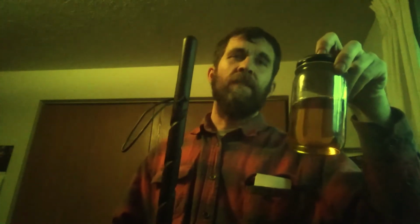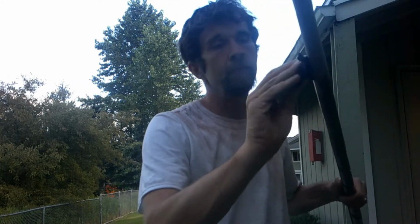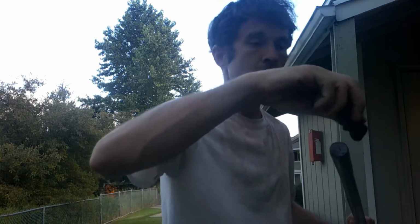Lo and behold, I got it back to the bare wood, like this black walnut one. This one actually had varnish before, and then I started putting boiled linseed oil on it, and then I thought, let's take back that boiled linseed oil. So I got all the regular boiled linseed oil off of there, and I started putting this on. I must have put about 50 coats of flaxseed oil on this one. At one point I was putting on 2 coats a day, then 1, and a couple of times 3 coats, soaking it in and soaking it in. Then when summer came around, I put it outside and let it soak in the heat, bake in the sun, and then cure.